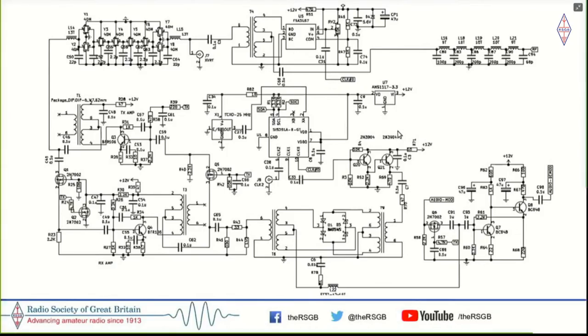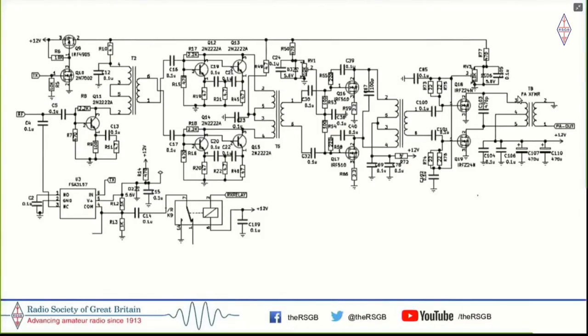The whole idea of an SDR is that the hardware is simple and you do a lot of your work in software. For example, you don't have separate filters for FM, CW, SSB, lower sideband, upper sideband. You don't have different detectors. They are all gone because everything is done in software, and we'll get to how it works in the software in a bit. So this is the power amplifier.